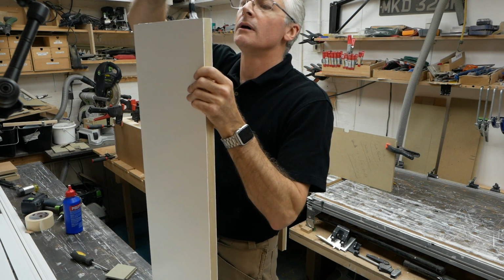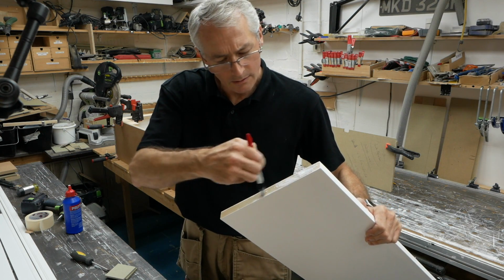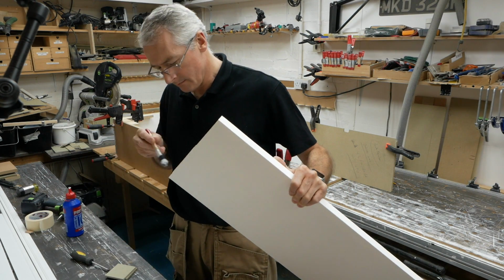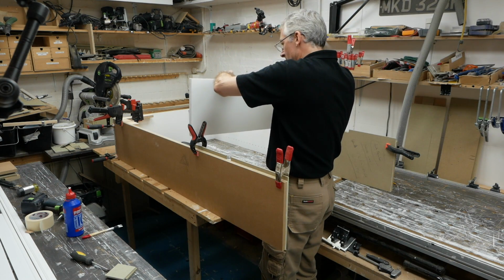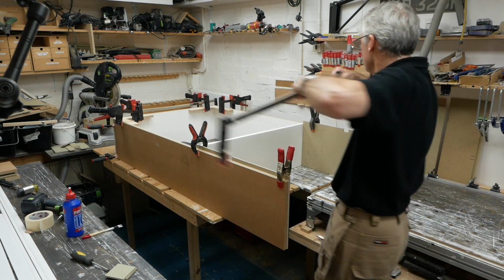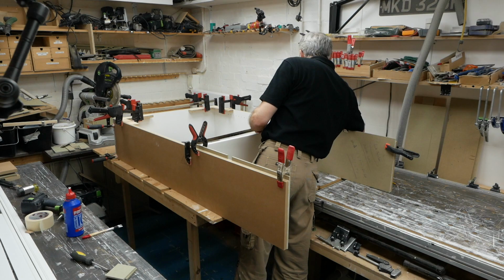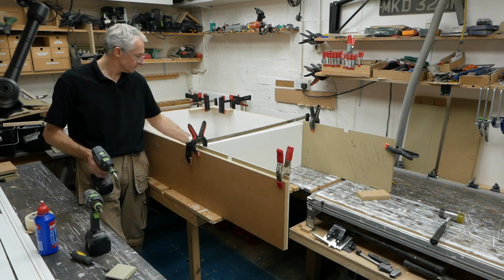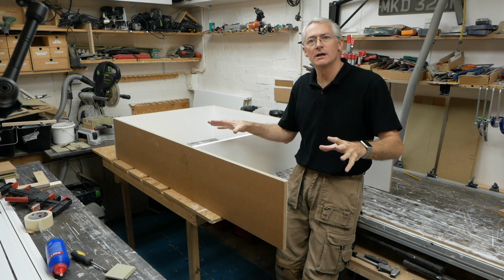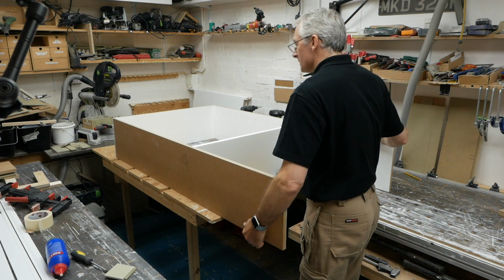Generous dollop of glue. Both sides. Then, with a little glue, the shelf is carefully fitted in position and held there with a clamp, while I fix it down permanently with a few long screws driven through our centre line. So while the glue is relatively soft, I'm going to flip it over and get the back on it, so it'll pull it into square for sure. So I'll just do that now.